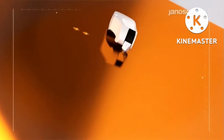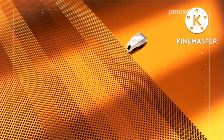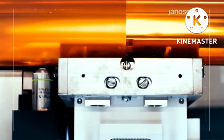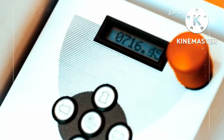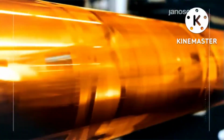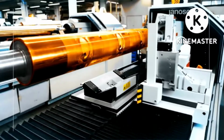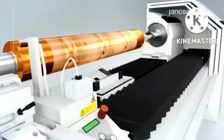Driven by electromechanical pulses, the diamond stylus engraves the so-called cells into the copper surface. The size and depth of these cells define the ink volume to be transferred onto the printing material during the print run, and consequently the color density on the printing substrate. All engraved cells reproduce the full packaging motif to be printed later on.